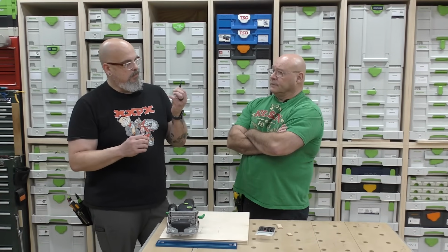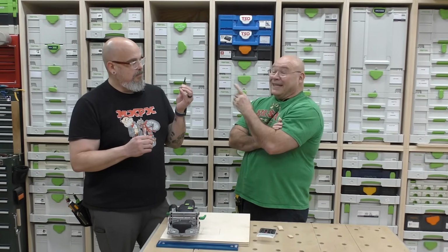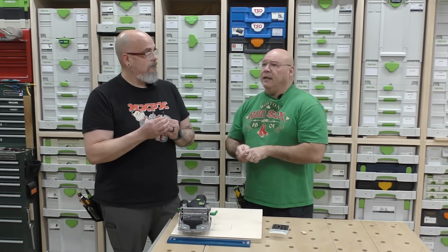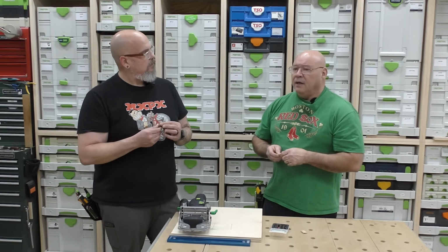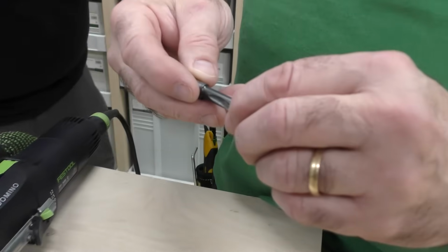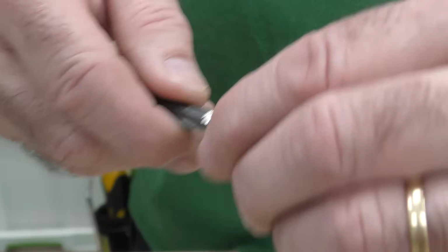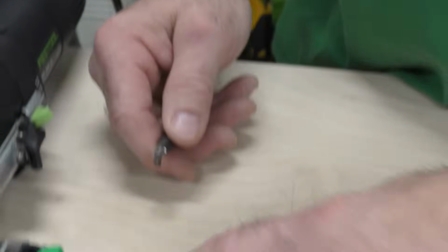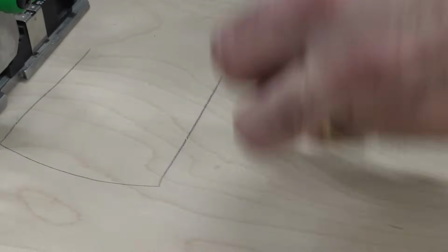That's awesome. All right, Sedge, so I got my 8mm bit here. Can I get this thing sharpened? In theory, yes, you can, but don't. Just get a new bit. And when I have told people this, they go, huh? If we look at the bit itself, give me in here, cameraman. This is so precise, the mortise it cuts. If the sharpening company takes a little off the top, you're sanding your Dominoes to fit, and you'll lose a lot of glue line doing that. So it's better to just get a new one, and these last a heck of a long time.